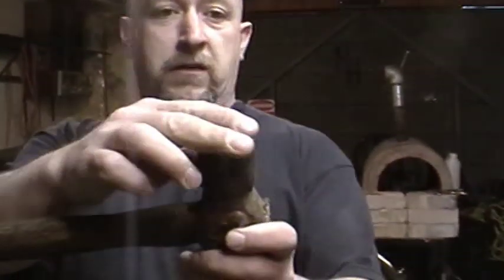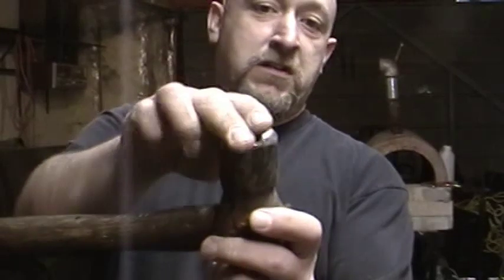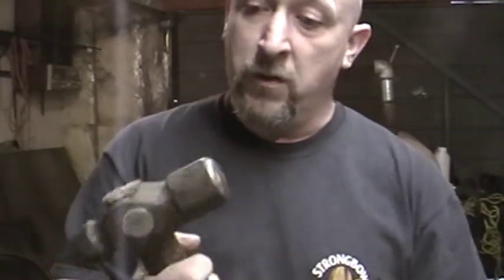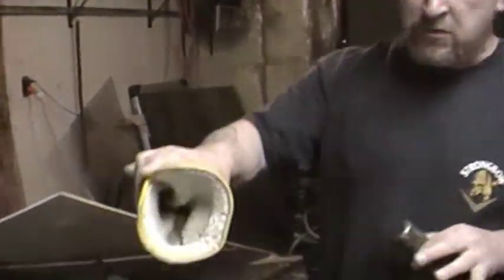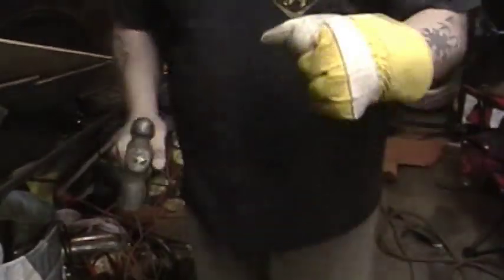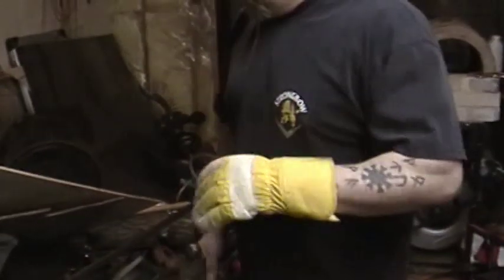Armoring 101, dishing. If you take a look at this hammerhead, you'll notice that it's got a slight bevel to it and it's very smooth — it's been polished with a grinder. This is what you want for basic dishing. You're going to want a glove, approximately something fairly thick and padded. I like these ones with fur lining. This is to hold onto your steel and to prevent shock going through your fingers.